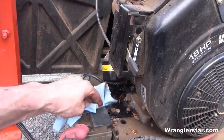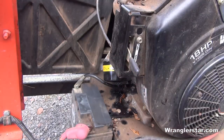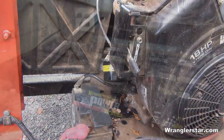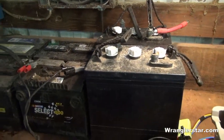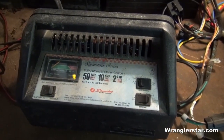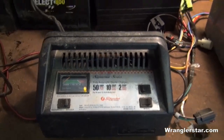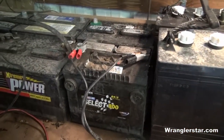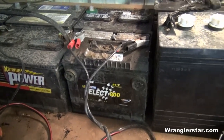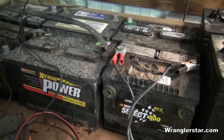You may have a small battery in your power equipment. Some of them need service and will have caps; some are sealed like this one and don't need any service. One thing you can do to save your batteries and make them last about five or six times longer is to take them out. I have a small battery station in my shop. With just an inexpensive automatic battery charger, take your batteries out of all your power equipment in the wintertime, bring them in, don't sit them on concrete — sit them on a wood bench or wood on the floor — and charge them up. Let each one sit for about 24 hours, then move the clips over to the next one and make sure they stay charged.